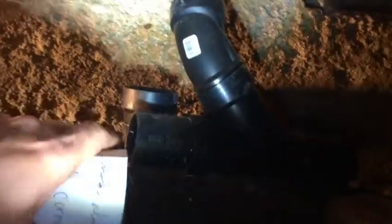Made a nice clean cut. The technique for that is you wrap a piece of paper around the pipe so it's nice and straight, then you draw your line. Come in with the Sawzall and make a nice clean cut — did that on both sides.